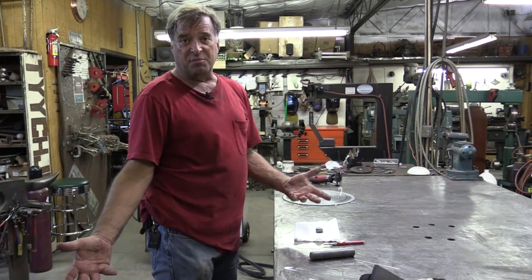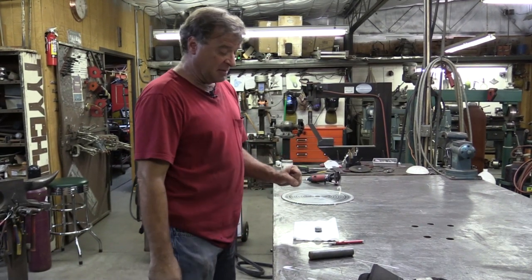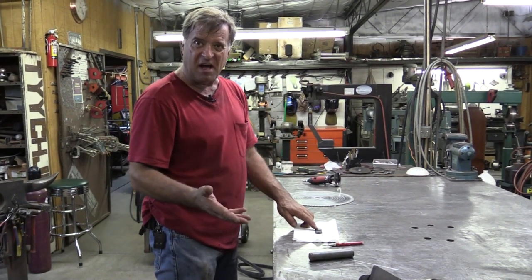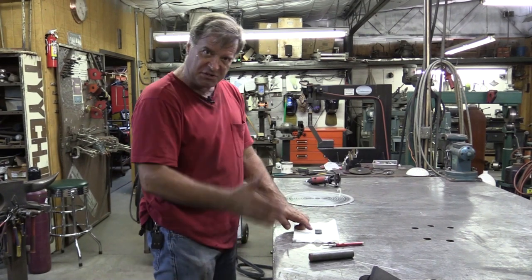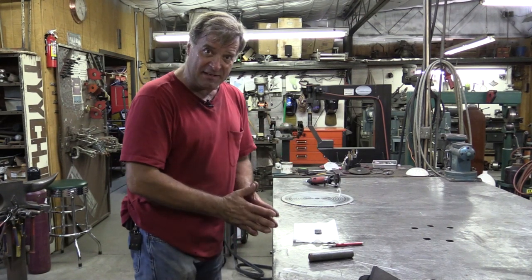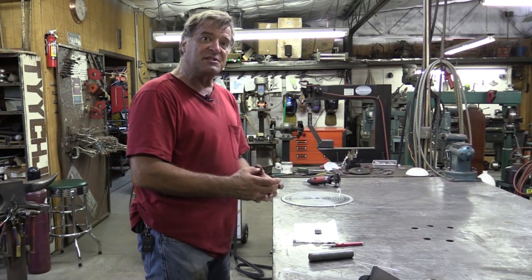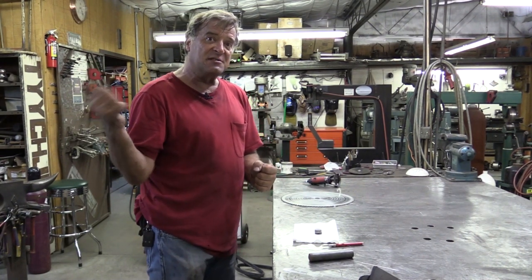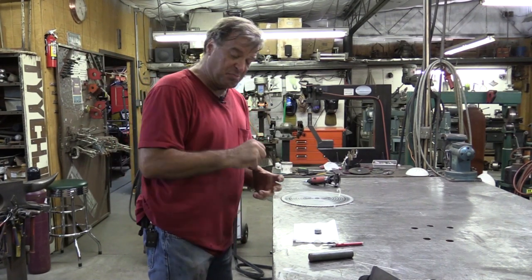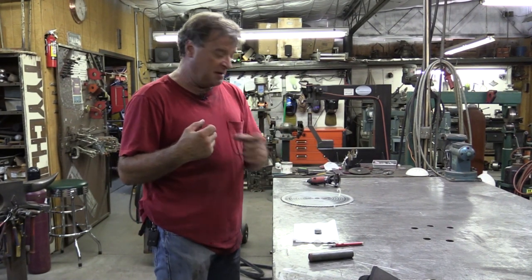So why do you want to make sure your blade's sharp? Why can't you just say I can get one more cut and push it a little bit? Well, you get a worse cut — more of a wiggle, an ugly cut instead of a nice clean smooth cut. With a dull blade, you're putting more heat into your material. It's expanding more. There's more chance of whatever you have clamped in that vise coming out, because that blade is dragging as it goes through. You're pushing on it, it's grabbing, it's getting hot — there's more chance of that thing popping out.